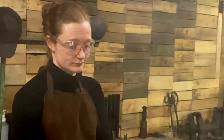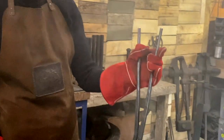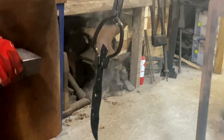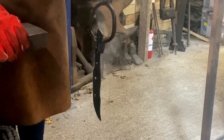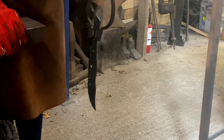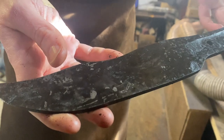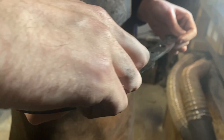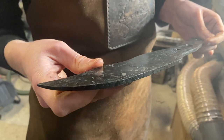The quenching is rearranging the chemical bonds, bringing everything closer together — what's called a fine grain structure — making the steel tougher and stronger. It also makes it incredibly brittle, so the next process is tempering, where you make it a little bit softer so it's less likely to chip. It was so shiny, and that light gray you can see underneath is an indicator of martensite — a hardened state of steel.